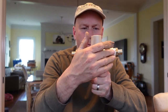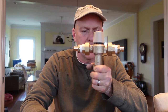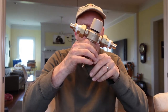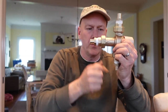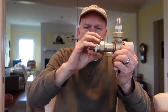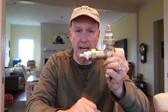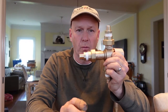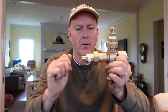So basically what's gonna happen here is we've got our hot water that would normally be run into all of our point of use things. In this case, it's gonna have to get set up something like this, where this will head out to the point of use, a little bit of cold, our hot water. And remember, both of these are screened so that when it comes out here, it's already kind of filtered. We're gonna put this behind the filter so that the water going to it is filtered, but the screens are gonna help us out as well.